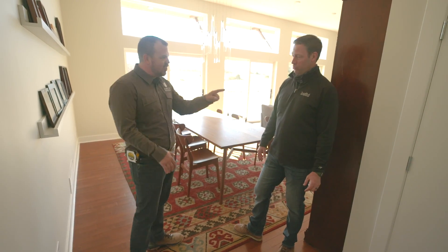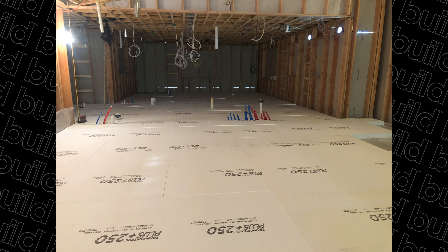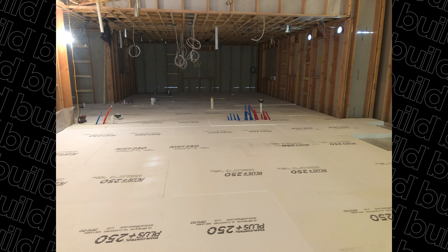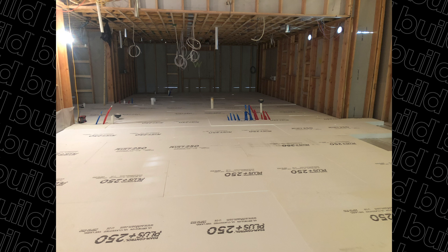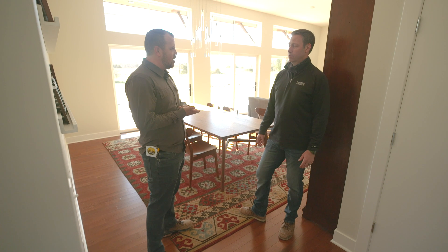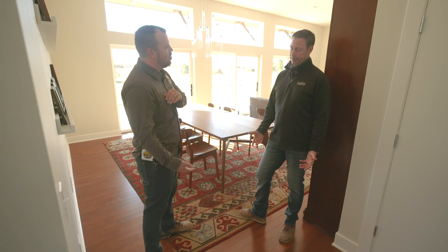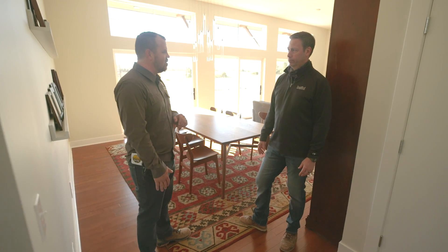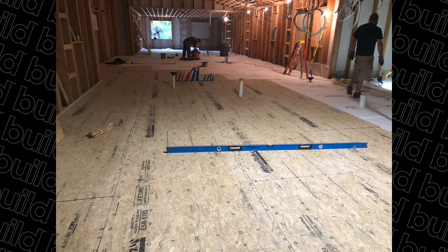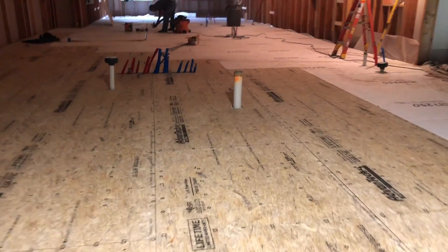Just like what I did at my house — foam and everything on top — we just don't have the concrete underneath. We have four inches of XPS foam, so it's R-20, in four-by-eight sheets, one layer. We talked about doing two layers and offsetting them for better R-value, but we realized the delta T between the interior and the 54-degree ground temperature wasn't worth the fight. Then, same as what I did, two layers of Advantec offset 90 degrees with seams shifted, glued and screwed. Huber has an engineering standard for it now, so we can keep the warranty.